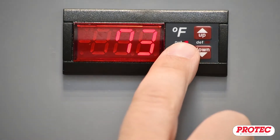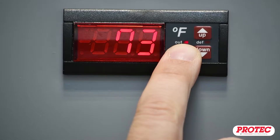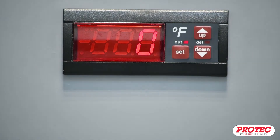To access the Parameters menu, press the Set button for at least 8 seconds. The display will automatically change to zero. Release the Set button. This is the password to access the Parameters menu. If your password is the factory default value of zero, then press the Set button to proceed.